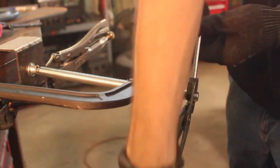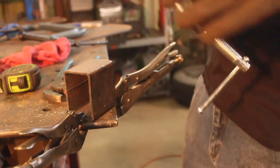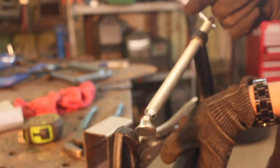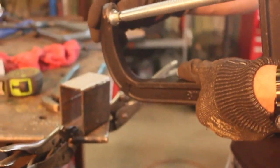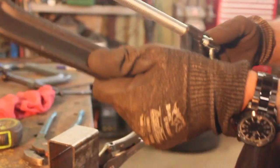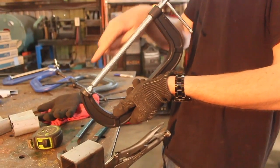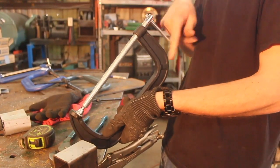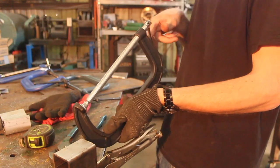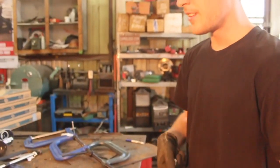I'm going to try and free it. That cap is destroyed. The Irwin had a little bit of a tear, but this thing is all wallowed out. Interestingly, to Bessie's credit, this thing is actually closing up straighter than I thought it would — it's still off by more than a quarter inch from where we started. What it looks like is that either the screw or this cast piece up here is bent, so every single time you tighten the screw, it does something totally different. Now it's off by an eighth inch one way, and last time it was an eighth inch cattywampus the other way.